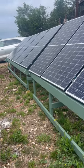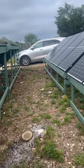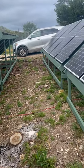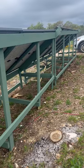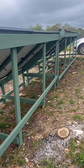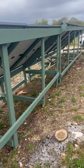Here are the reasons I chose to do ground-mounted solar racks rather than on my roof. Number one, they are more efficient this way because I'm in Texas and in the summertime it gets really hot. On your roof it is boiling up there, so they can get more airflow down here, which makes them run more efficiently.